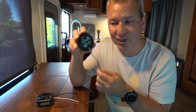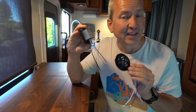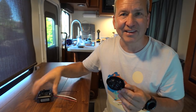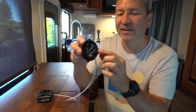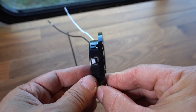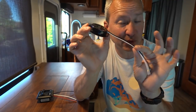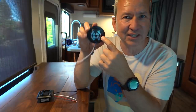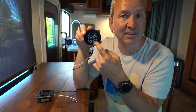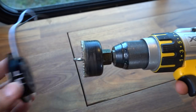What makes this a little more challenging is that the puck light and the dimmer are designed to be recessed in the cabinet. So we're going to have to drill a hole to accommodate that. You can see the profile here — it's not recessed much, but it's just enough. It looks really nice when it's flush mounted, but we're going to have to drill a hole. I think it's a two and one-eighth inch hole — a standard hole saw that we'll use for that.